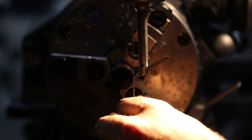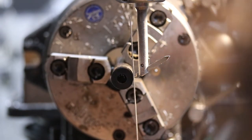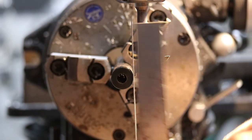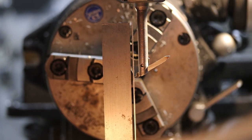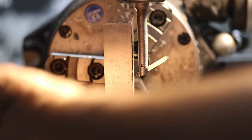So I roll it in until the ruler is pinched on there. And then when I move the table up and down, no, it does sort of work. The angle of the ruler changes, and the ruler is like magnified over the top of it. So all I do is, actually, where's a square? I'll put a square in here, probably from this side. And then I move the table up and down until the angle of the ruler matches the edge of the square. Looks like about there. And so that should mean that my tool is now bang on.